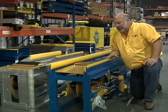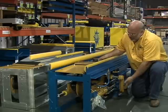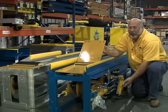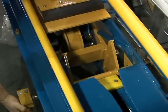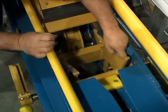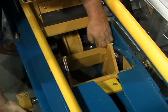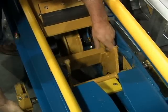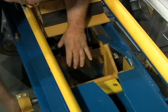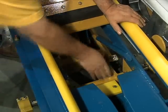We incorporated an air take-up system with an air cylinder that puts the roller-up fork assembly in position ready for roller-up. When the roller fires, it brings the fork to position, and as the next roller comes through the rack it hits here and lifts by the force of the roller, bringing the roller up to the top deck. It then falls back down again waiting for the next roller — no matter where we fire, it picks it up to the top deck.